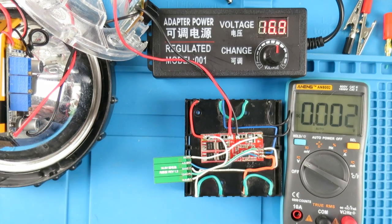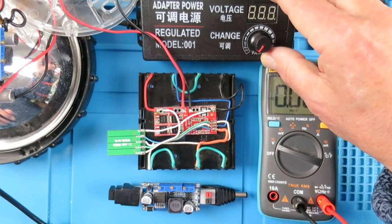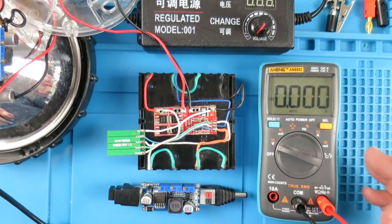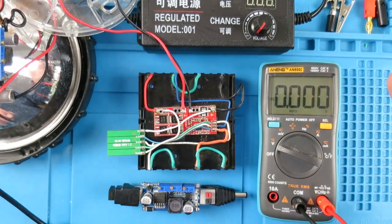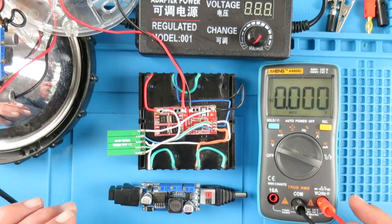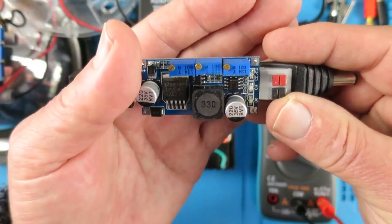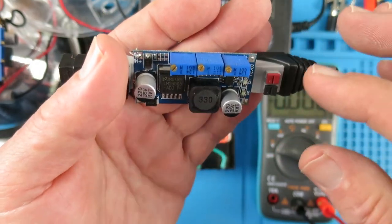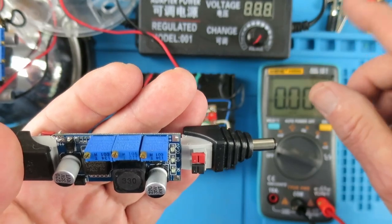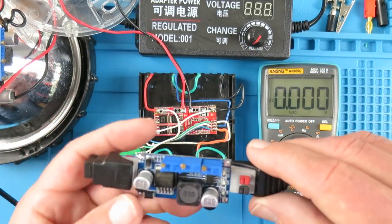In terms of the charger for this project, I recently reviewed this variable voltage power supply which goes from 9 to 24 volts. To charge the batteries we'll need to apply just a little bit over the 16.8V — say 17 volts — to give it some headroom. The wrinkle is that it's not constant current, and for LiPos you really need to use a constant current source. So I'm going to add this little DC-DC converter that has the ability to set a constant current. We'll set the output voltage to 17V, with the input at around 20V — you need at least 2 volts difference between input and output.